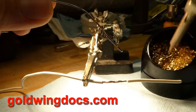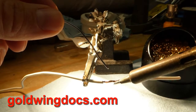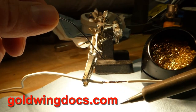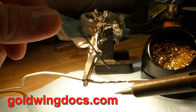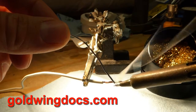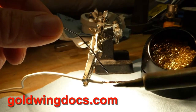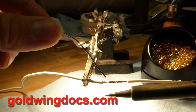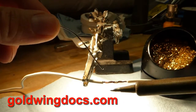So let's try again. What I'm going to do is put the tip of the soldering iron on the wire and touch the solder to the soldering iron just to get it starting to melt — and that's going to get sucked right into that wire. Because the melted solder conducts heat better than anything else, and because it's already flowing throughout the copper, it will then allow us to drag the solder along the wire and it will just suck it right up inside.